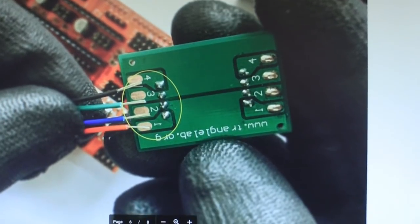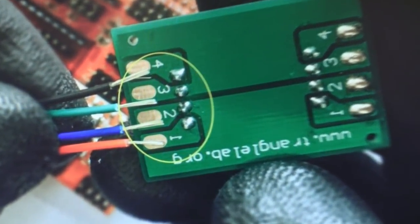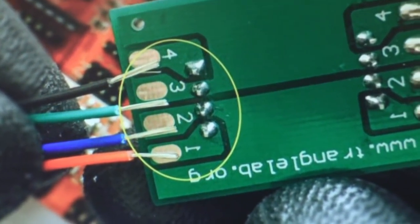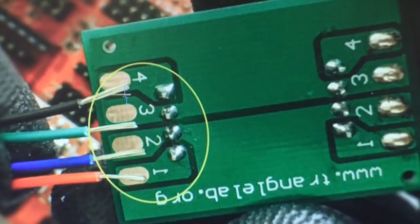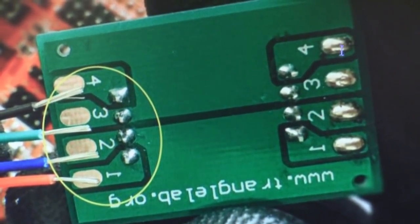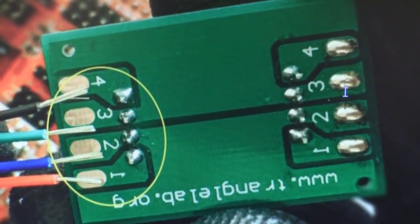The back of the boards here — you can see — can have your connection wires soldered directly to the board. You can see how that's done; it's pretty simple. You've got one side where you've added solder, and this side is without solder. You can add your solder on there, stick your wire on there, heat it up, make sure there's nothing — no wires crossed or anything like that.